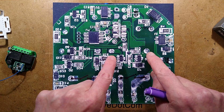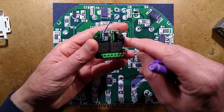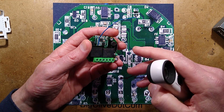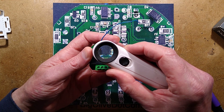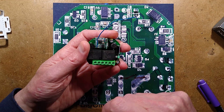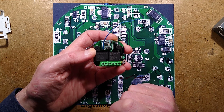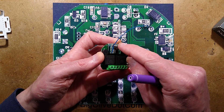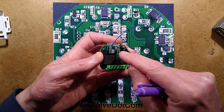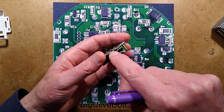The 5 volts is used for the two relays underneath - these pins here are the coils for those relays. The top circuit board in the stack is a 433 MHz receiver. I can tell because it's using a generic chip which, when searched, says 'equivalent to blah blah blah' - meaning it's a clone. It's got a crystal of 13.52127 MHz, which equates to a 433 MHz receiver. There's a small chip here which is probably just decoding that information and storing code, since this can be programmed by pressing buttons in various combinations of pulses or long presses to enter various modes for programming the open and close switches. Underneath that, with its little screening can, is the Wi-Fi receiver with an antenna on its circuit board.